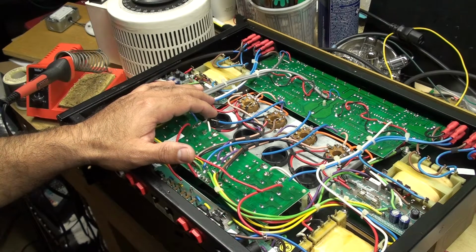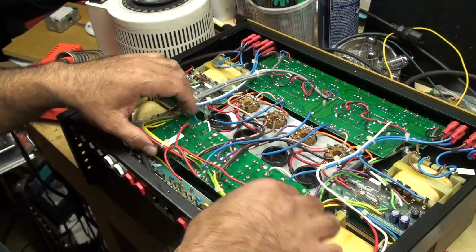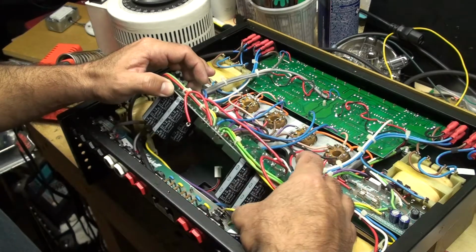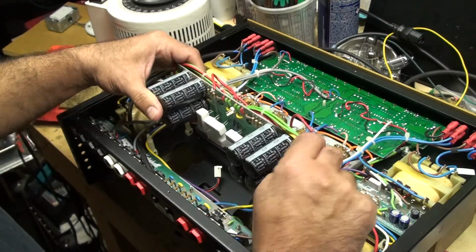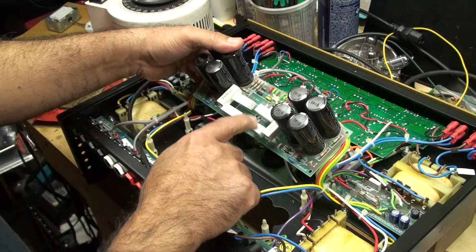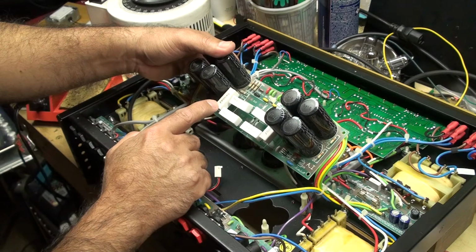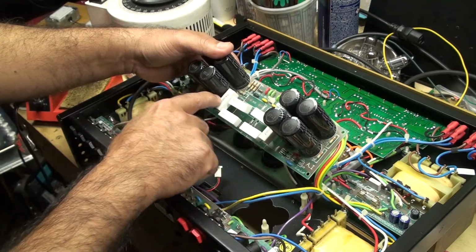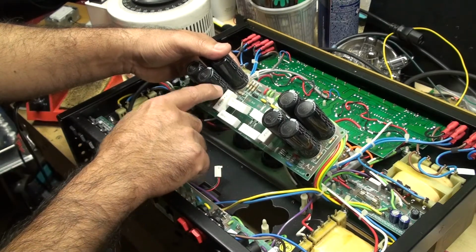And so what I want to do first is I'm going to replace the screen resistors that are here underneath this part of the amp right here. These right here, and this 5 watt 100 ohm resistor here. These are your chokes apparently. So if I replace this, it will be like putting on a choke, but these resistors are going to stay.